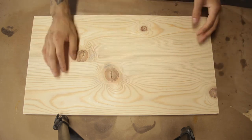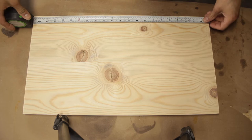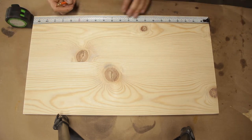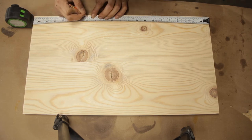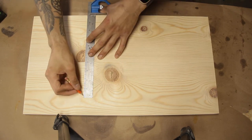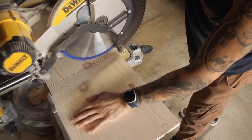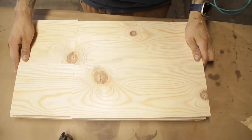The next thing we have to figure out is how wide we want the adjustable part and how wide we want the part that'll be glued to the base. I want this to fit a 15-inch laptop comfortably, so I'm going to mark 15 inches — that'll still give me nine inches to place your notebook or coffee without anything moving. Then go ahead and cut on your mark and this will give you your two pieces that'll make the whole desktop.